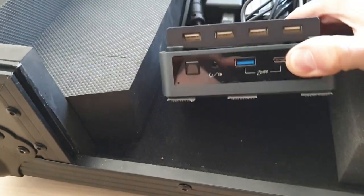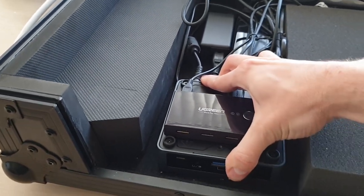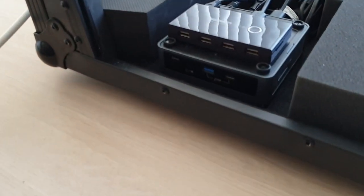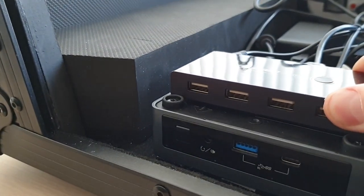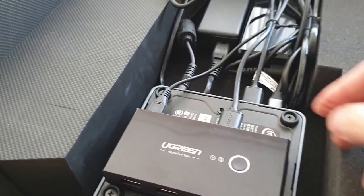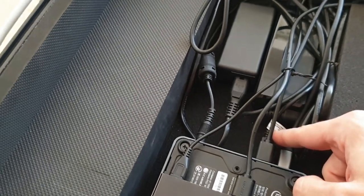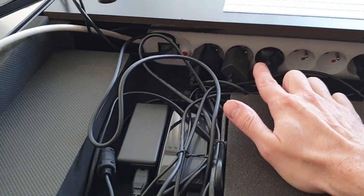My workflow is doing the prep work on my laptop where my full library is stored, whether I'm on the move, outdoors, or just relaxing. I sync to USB, then connect my USB on the USB hub connected to the NUC — just like you would do on an XDJ-XZ or CDJs as standalone. The Intel NUC is attached using Velcro so I can pull it out or reposition it. The USB hub is attached with double-sided tape on the NUC. It's currently a USB 2.0 hub, which is fine for just reading tracks, but I will upgrade it to 3.0 for faster file transfer. The USB hub is powered by a micro-USB cable and connected via USB to the back of the NUC. Everything is routed and powered by the main power strip.